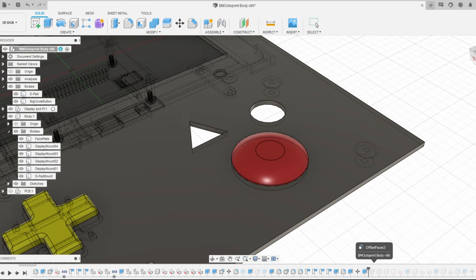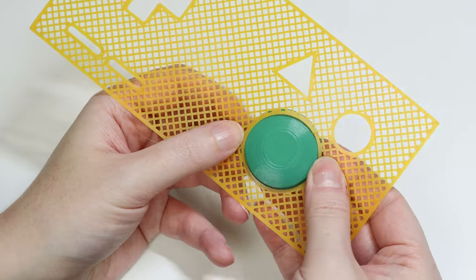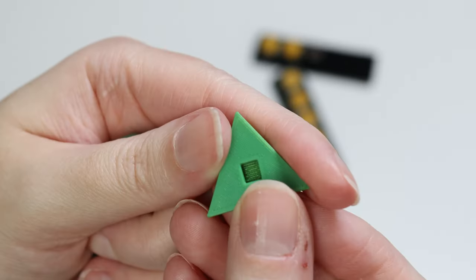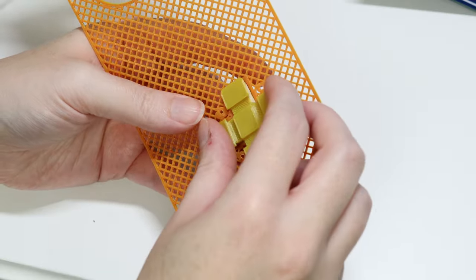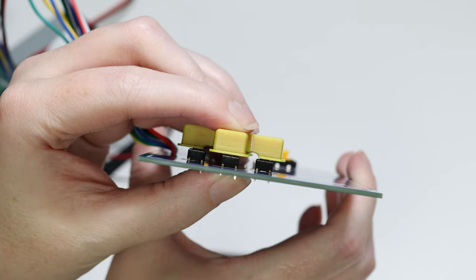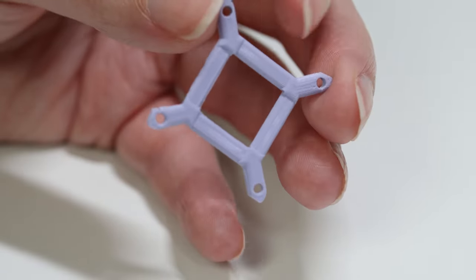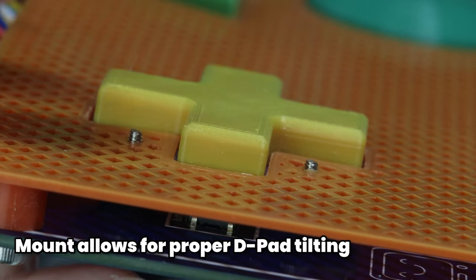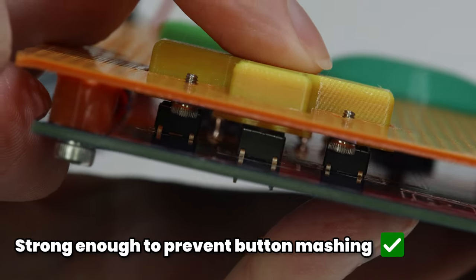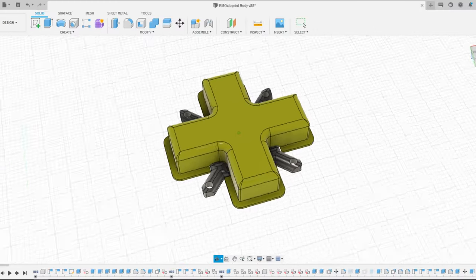I started with the faceplate and the buttons, because that felt like a really important part to get just right. I test printed the pieces numerous times to make sure that the fit and functionality were good and consistent across the board. The buttons were designed to be printed in a hard plastic instead of a soft, flexible one, and so they worked great with just this little inset to slot right onto the tactile switches. The D-pad was a whole other kind of challenge — it also needed to not mash all the buttons at the same time. The winner ended up being this little screw-in 3D printed mount, satisfying all of what turned out to be a rather long list of requirements.